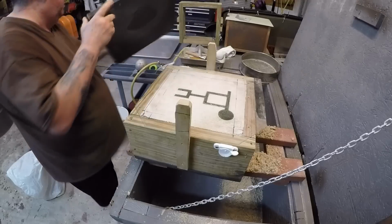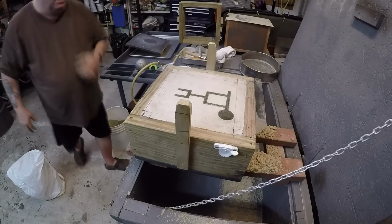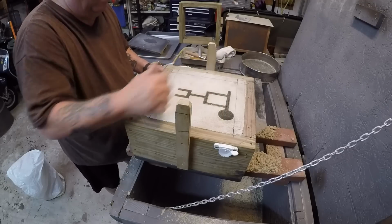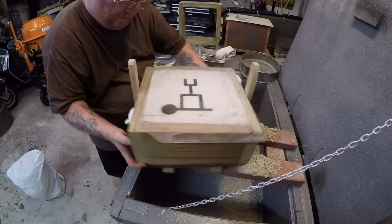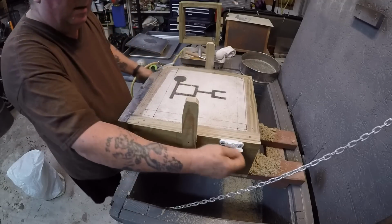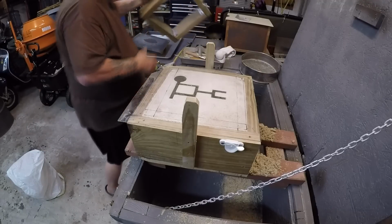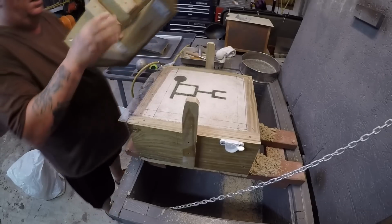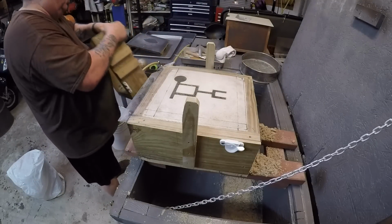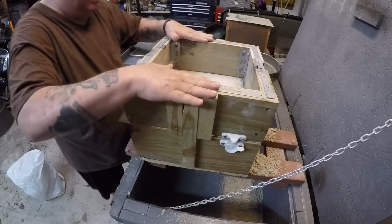now that was the molding board. You try to keep one of your boards just for molding so you don't have digs in it and burns in it later on. Okay, I want this over here, so I'm going to flip it around. Okay, now here's my top, or cope. I've got it marked so it comes in just a certain way. As the other way, it fights.